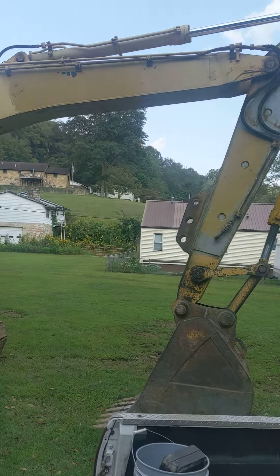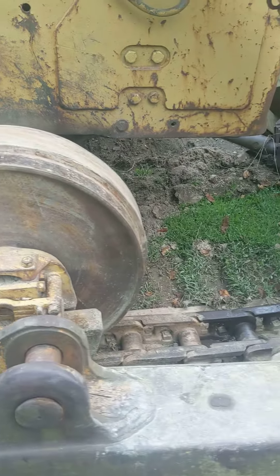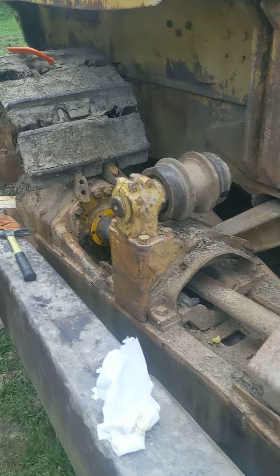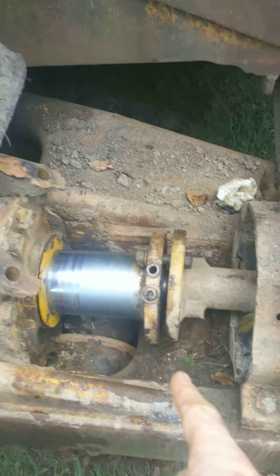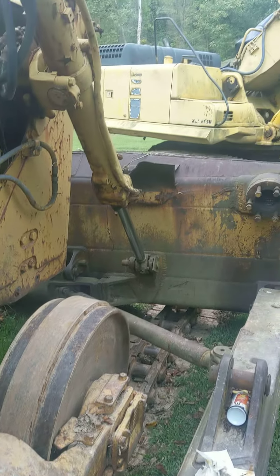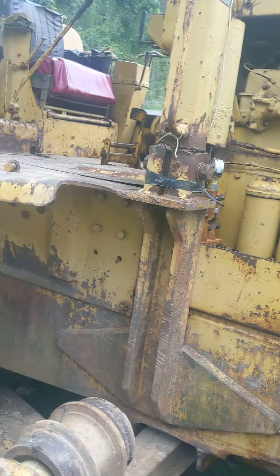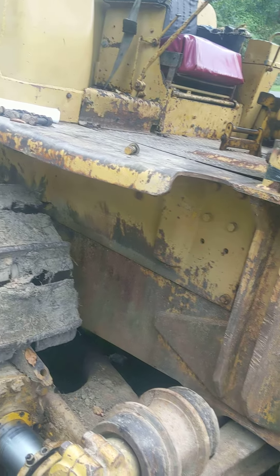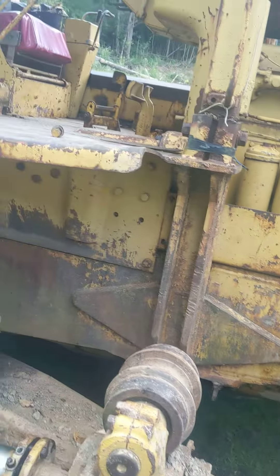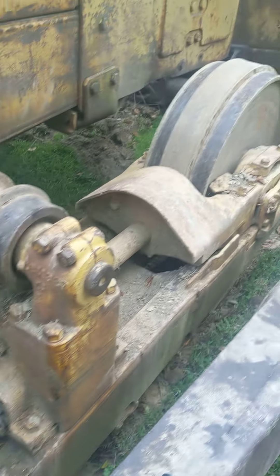This Komatsu has been a big help — having that thing so I can move the frame roller, the idler, move the idler back and forth. It's a big deal to be able to move the idler back and forth. I tried pulling on it with a pickup truck and a chain, but finally I just brought the excavator down the hill. You need some kind of hydraulic arm, some kind of excavator or something like that, to be able to bump this idler around.